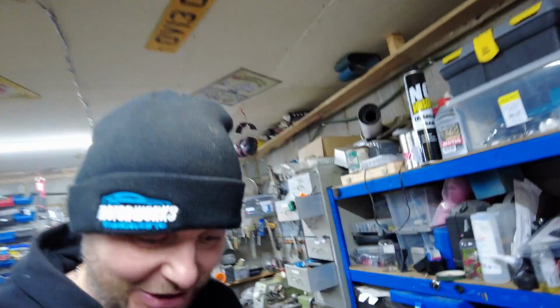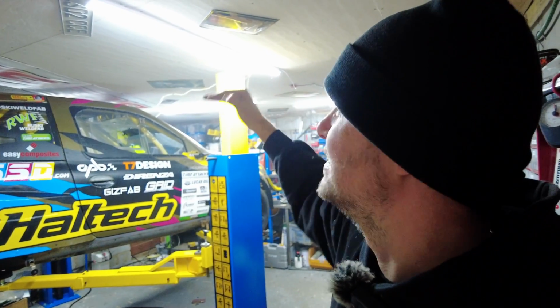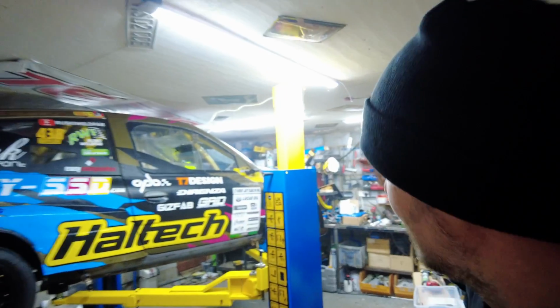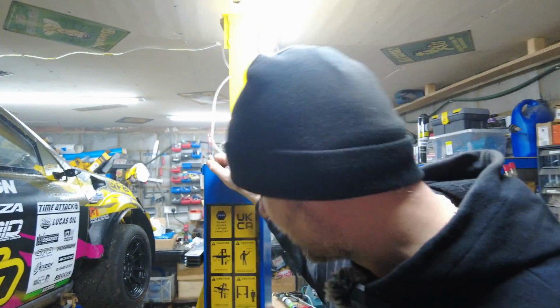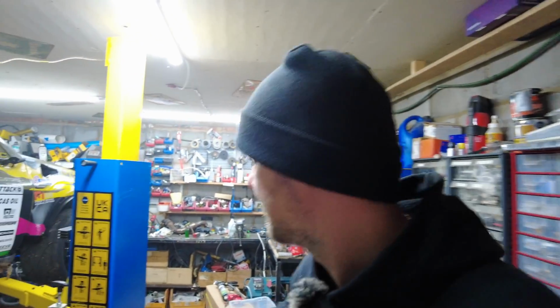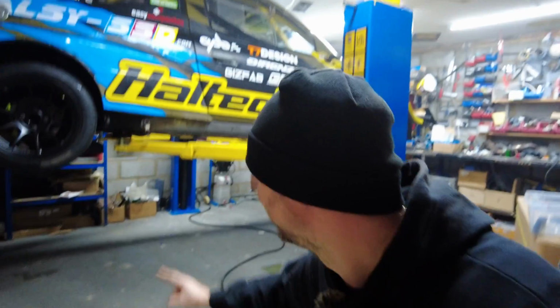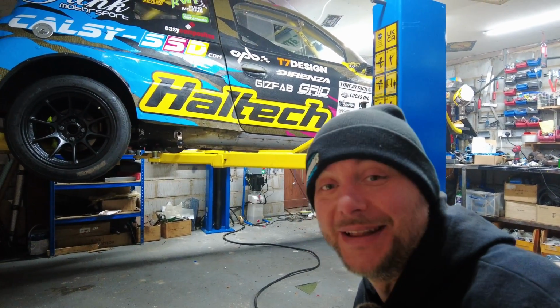Small garage, absolutely fantastic. It works. And I have a little bit of room to spare. Right now it's basically on the locks, so I don't think it can go a little bit higher, but then obviously it needs to be on a stop on the locks. So now you know that if hydraulic fails, it's physically on the locks in the columns. Now what I need is more light underneath. It would be nice to have like a really long strip LED.